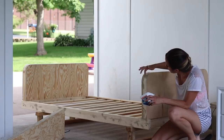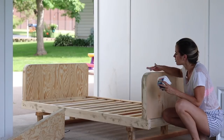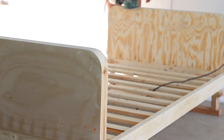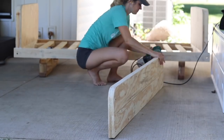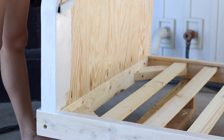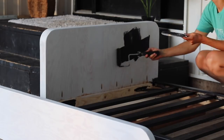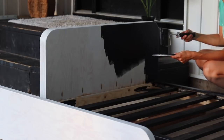Finally, I was done building and it was time for finish work. I'm applying a lot of wood putty — I used almost an entire tub of it. I really wanted the finish to be so smooth on this bed swing. I filled in the edges of all the plywood so I could sand it completely smooth, and filled in any imperfections on the 2x4 so you would never know it was just pine. Then came 6 hours of sanding in 3 different grits — I started with 40 grit, went to 80 grit, and ended at 120 grit. Then I primed using Kilz Premium Exterior Primer, which I'd definitely recommend. I primed the parts that would be used a lot and would be getting two coats of black paint. My first coat of black paint I painted the entire thing, even the parts that wouldn't be visible. Then the second coat I just put on the areas that would be showing when everything was put together.